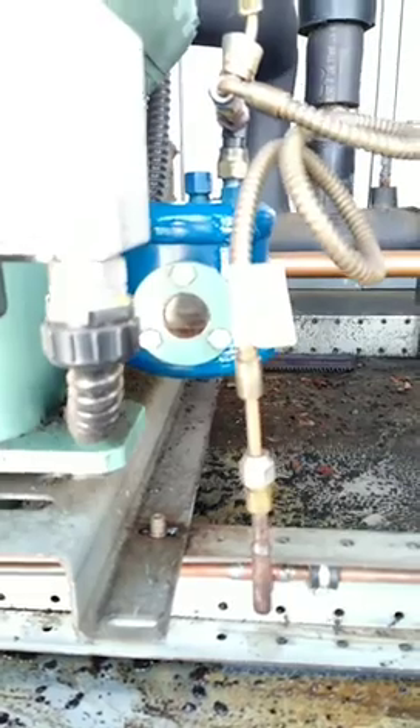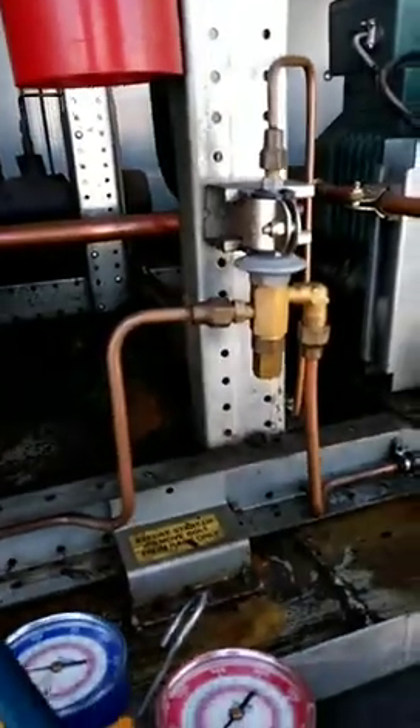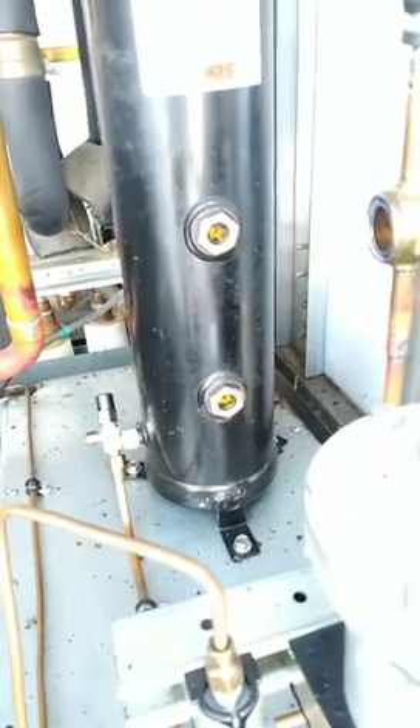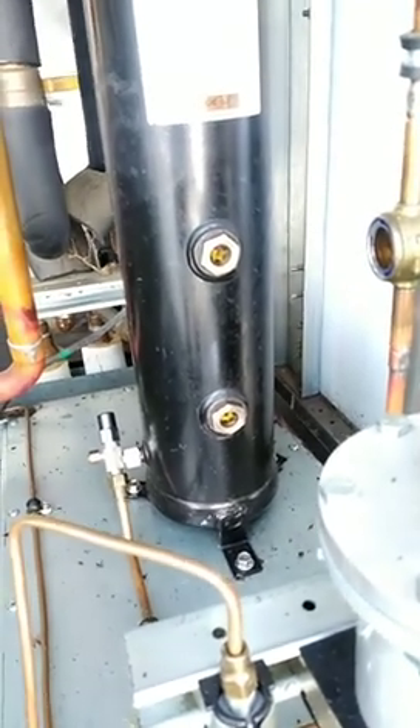You can see the glass is kind of low, although that level in there is sufficient for Bitzer, but if you look further in, that pot might not be completely level — it might be tilted forward a little bit. But usually it is a high-pressure oil system, so it's a separator/reservoir combination. I see that you should never really have the top ball full, but sometimes it's completely empty, even empty out here, locking out all of the medium temp side.